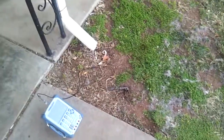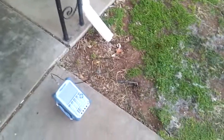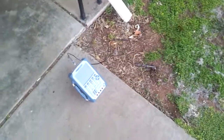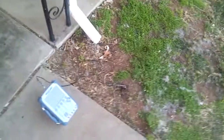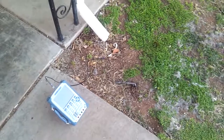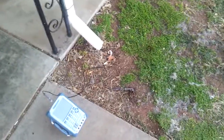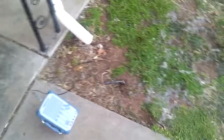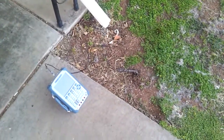Whatever it takes to interface it — you can use some of these Chinese two-way radios that are relatively affordable and have a little bit of power. If you're a ham radio operator or have a GMRS license, you can use that power. Or you could tie it to some off-the-shelf GMRS radios — go get some cheap Cobra radios. Package the whole thing in a NEMA box, camouflage it, stuff it out somewhere, and make sure you have another radio tuned to the same frequency. Set it up so when the sensor trips, it keys down the radio, fires off the voice playback circuit, and you get a radio alert when somebody enters your property. Just a thought — playing around with it for giggles. Let me know what you think, any suggestions.